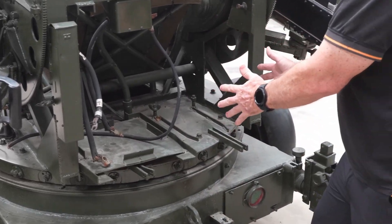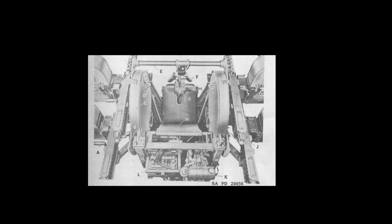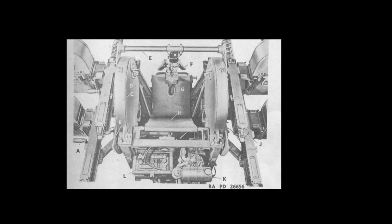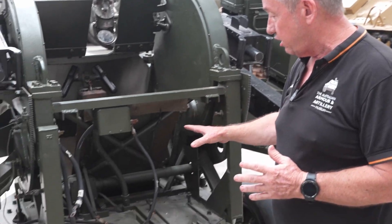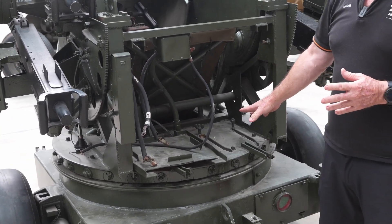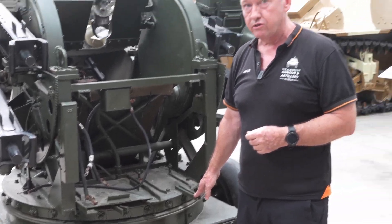To its right, which we don't have at the moment, is a Briggs & Stratton 12-volt generator putting out about 300 watts — essentially about 5.5 horsepower with a 7.5-litre tank — so this generator will charge these batteries in use. Later variants were also known to have a Delco generator out of an M5A1 Stuart.